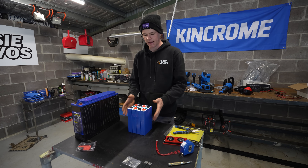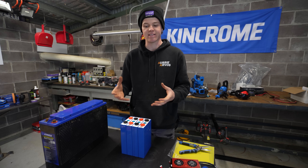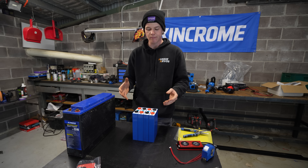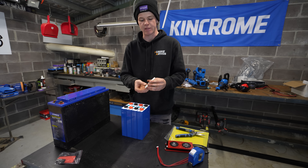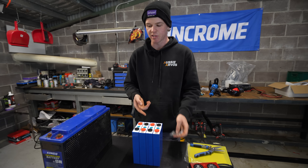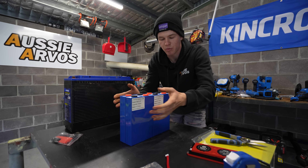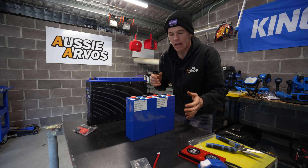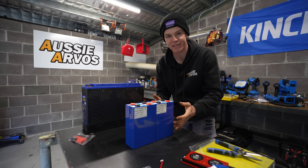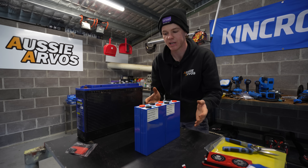Our first step is to connect our cells in series. There are a couple of ways to do this depending on how you want your battery to fit or the space it needs to take up. Generally these cells are designed to be connected in series in the formation they come in, but that's limited by the bus bars they're sent with — they're the right width to span between the cells in that formation. In order to fit in my casing I'm going to have to orientate them differently to keep its slimline profile. This was a big point of consideration when deciding what cells to buy, because I had to make sure they'd all fit inside the casing and I could still connect them correctly in series.